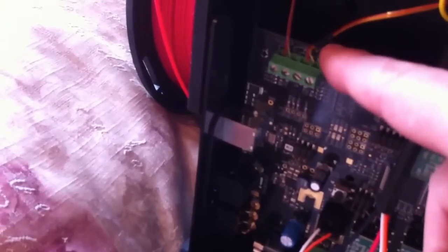If you look here, you can see that green little connector — right there. That is where the thermocouple cables come in: one for each extruder. What you need to do is unscrew those screws on that connector. If you have a different kind of connector, you may need one of those tiny jeweler's screwdrivers, because those are very small screws — just be aware of that.